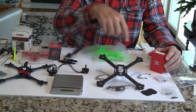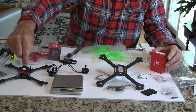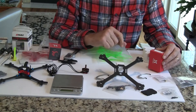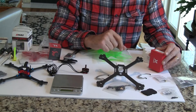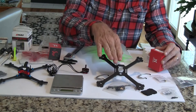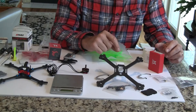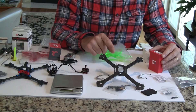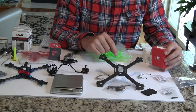It has a 20 by 20 stack, so I was going to take the ESC and flight control stack that I had for the Floss and move that over to here. It was a 28 amp ESC and an F4 flight controller, and that should be coming in the next couple of days. I also have a 20 millimeter format VTX that'll fit right on the stack, which is changeable in Betaflight for channels and power.